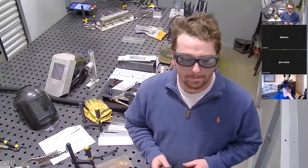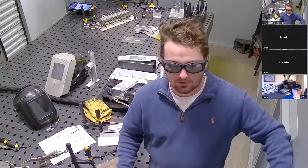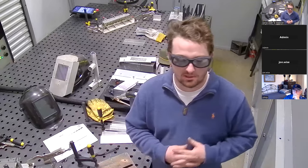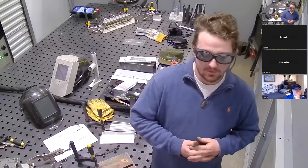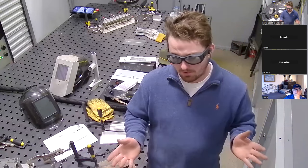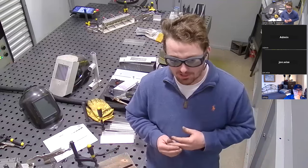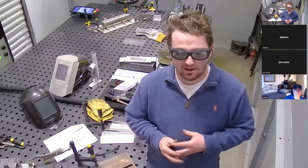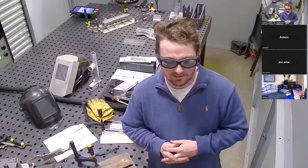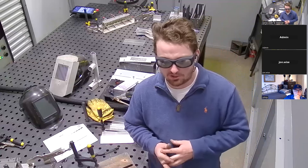As for the severity of injury if people don't take precautions — let's start with eyewear. You have to be very strict with it. It's a class four laser. The eyesight exposure unprotected — it has to hit the lens just the right way to focus and do the damage it needs to do. But if it happens, it can cause anything from dark spots in your eyesight to blindness very quickly. The damage is typically not reversible since it's internal to the eye.